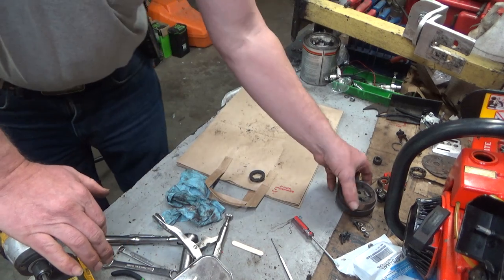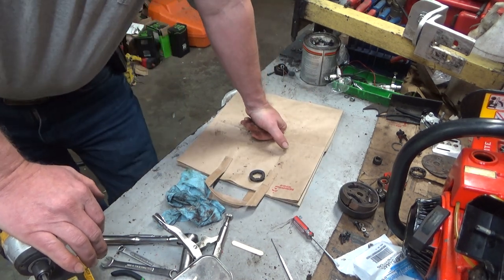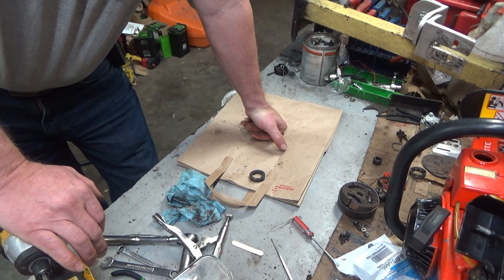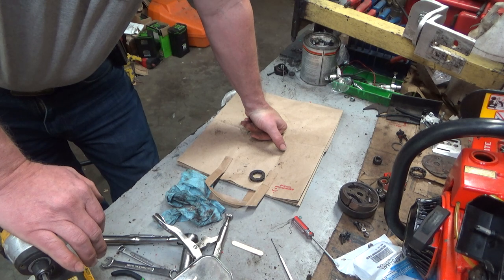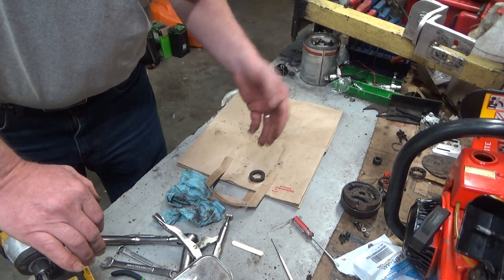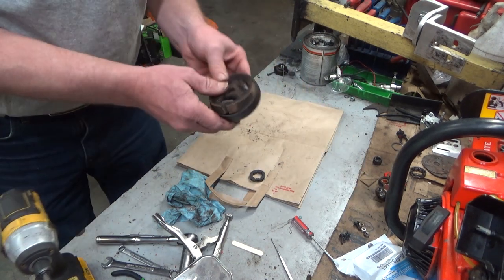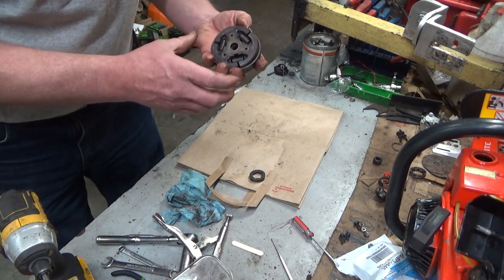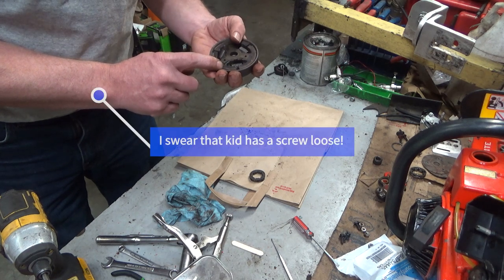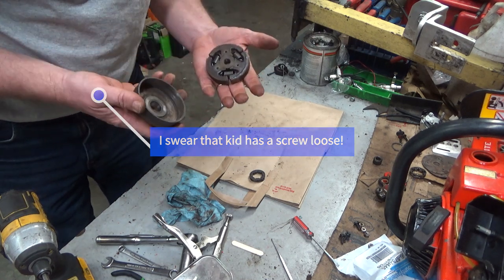Other than just the 94-126 clutch shoe, the part number is 93632, which was used in the 360s, and I think some 410s later on used it as well with this lining that can come off. And I'm sure there's plenty of other two-stroke saws out there that could use this as well. That's my solution that I believe is going to work for this particular clutch. We'll see how it goes when I get it on the saw and get the saw running — I'm waiting for an intake boot, otherwise I'd bolt this on right now. Fingers crossed, I think it'll work.